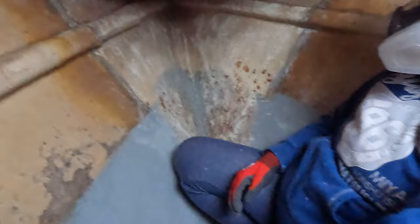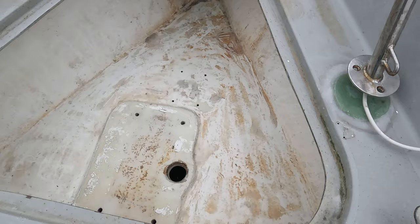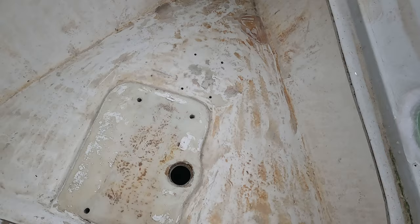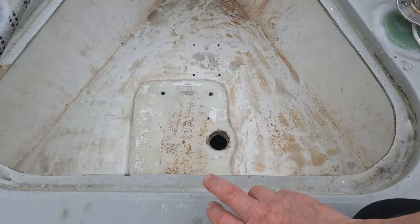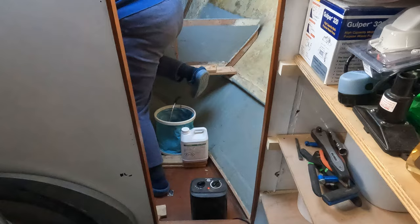While she was doing that I have ground out the holes from the anchor locker above, so I'll go and show you that. This is the old anchor locker — I've ground the bottom so you can see there are about eight bolt holes altogether that we need to fill. Our windlass is going to be at this level, and there's a new structure to be built for that which will of course rest on that plinth.